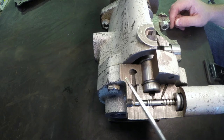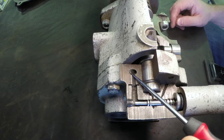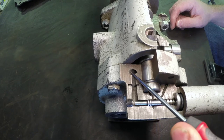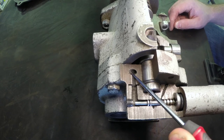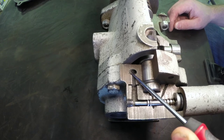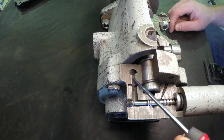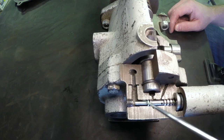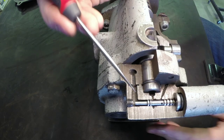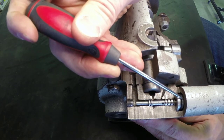This is a pressure compensator — this port right here is connected to our high pressure outlet port. High pressure is determined by the restriction within the system. The pump itself is designed to create flow, but if it's feeding a closed center directional control valve, the pump has nowhere to send the oil and it becomes dead-ended. When it dead-ends, pressure will rise and build up until enough pressure acts on the lands of this spool to push against the large spring inside.